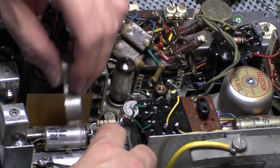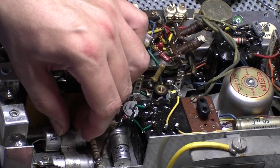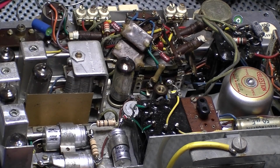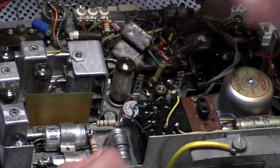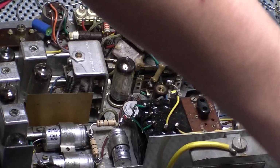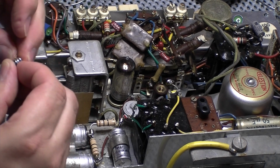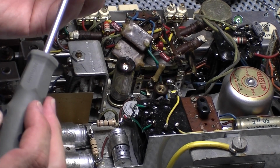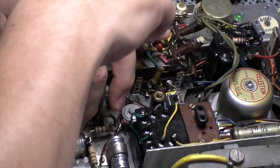I've put some tape incidentally underneath these capacitors, some electrical insulation tape, because they are touching against terminals underneath there for some bizarre reason. I don't know why, but that's how it was designed. Whether it's earth terminals, I don't know. It could well be earths. But as I say, these are slightly smaller than the original capacitors in diameter, so I'm having to pack the little screw that retains this bracket out with some washers because it's too long.